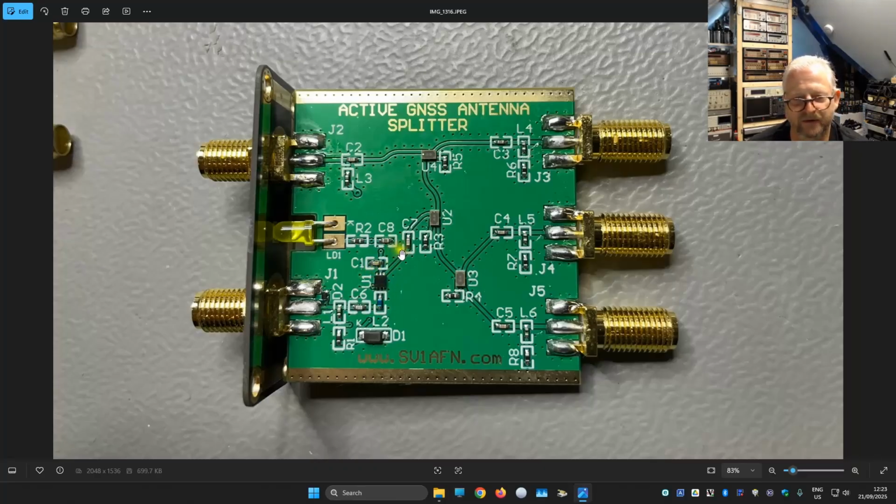then we have some coupling, and the splitter is here done just like I showed with the resistive. It splits first in two here, and then we have another one splits into here, split into here, and the same here. So here we have again the split for 3 dB, this one split again 3 dB, so we have again between the whole circuit theoretically 6 dB.